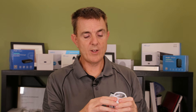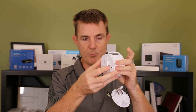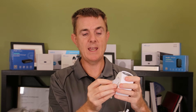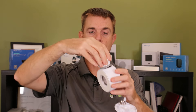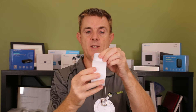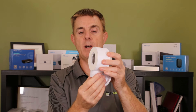We've got a few other options. We need to decide how we're going to bring our cable in — it's probably not going to be from the back. So we might want to use our plug and seal that up nicely at the back. Then we could use our end stop and screw that into place to create a waterproof seal. You might be inclined to mount it upside down just to make sure liquid was always running away from it.